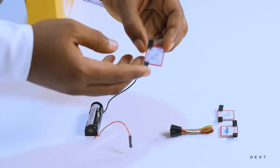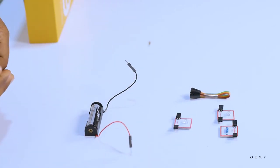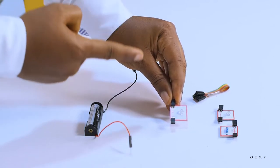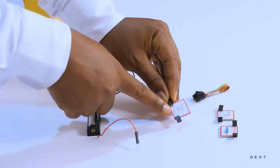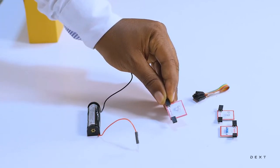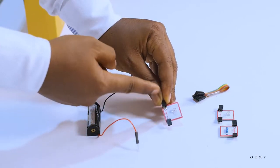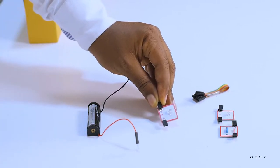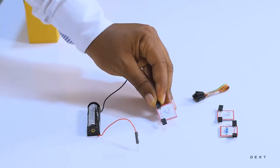We are now going to put inside this circuit our other electronic components. So we have a light emitting diode here — that is an LED. We are going to put that into the circuit. Do not forget that because it is a light emitting diode it has a positive end and a negative end. Using the arrow you can determine which part is negative and which part is positive. The back of the arrow is the part that connects to the positive side of the battery.